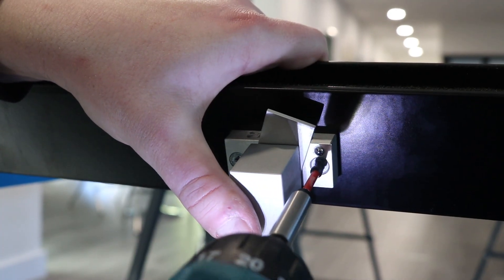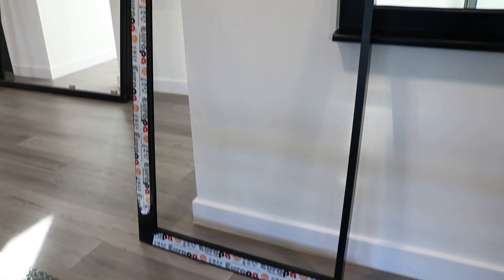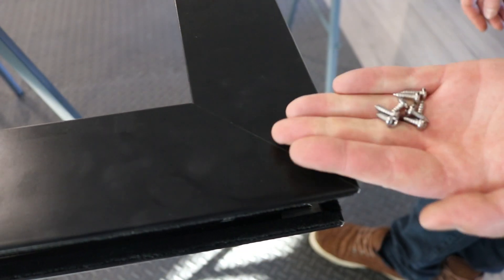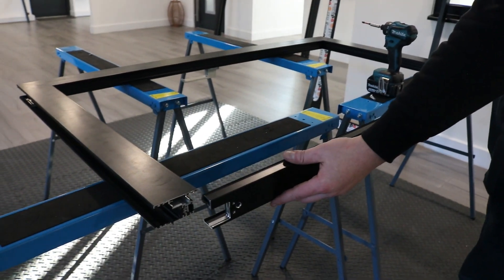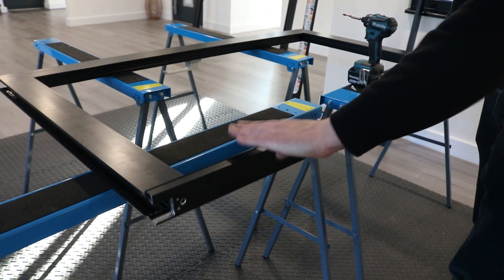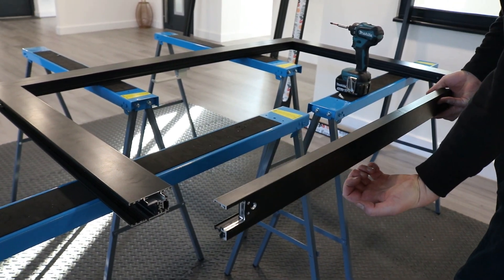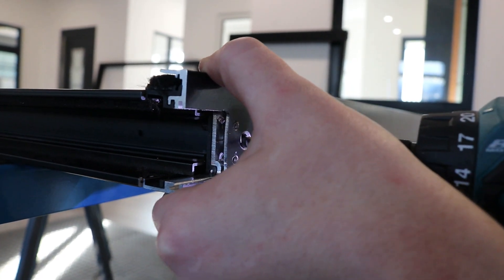Other lock strips and handles are available. All of the doors are put together in the same way — fabricate all doors the same as the first one, piece together and screw in the corners. The interlock can be screwed on either way up depending on which door it is. The internal door needs to be placed this way up so it interlocks with the external door, and the external door needs to be placed this way up so it interlocks with the internal door. Make sure to fully silicone the interlock side as well to stop any water from getting to the screws.